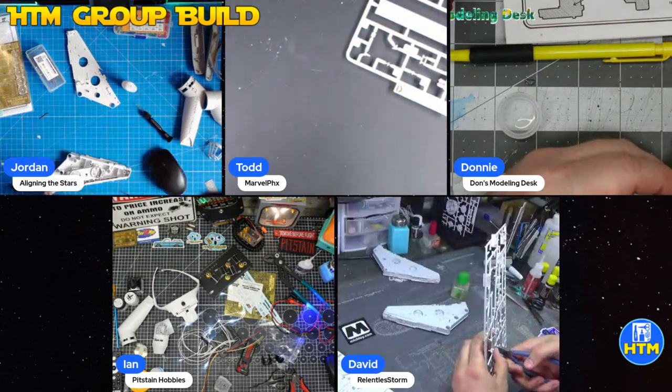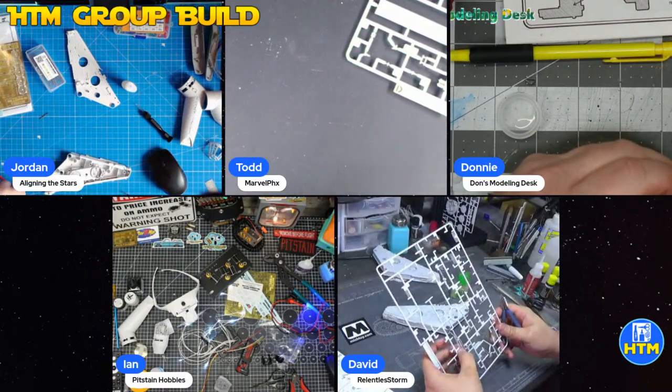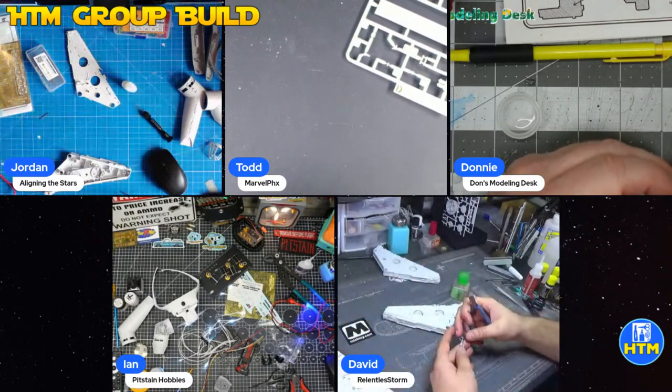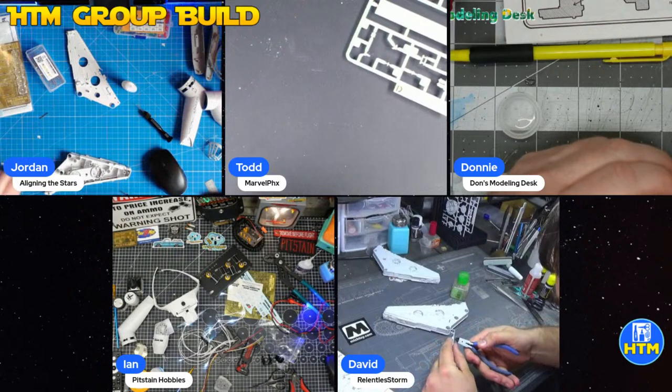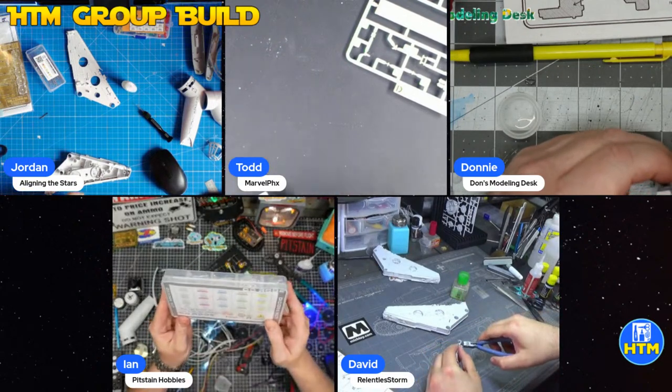So, super cool. You've got to look at the forward voltage of every LED. They all have different ratings. Each color has a different forward voltage. The reds and yellows tend to take the lowest, and blue and white can take higher.